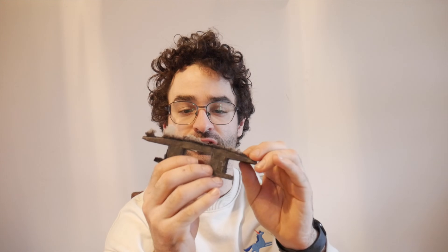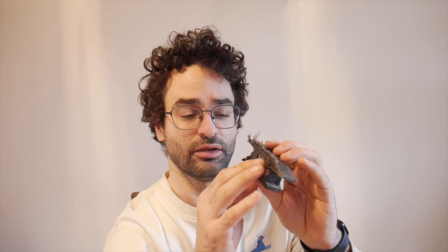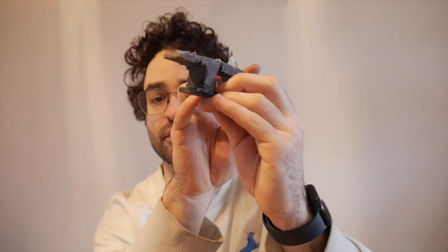We got the cleat out of the mold. There are a few small imperfections and some fiber running up around the plug, but overall it's looking pretty good and feels really strong. I just have to trim up the edges and do a little sanding. The mold unfortunately got destroyed during demolding — I had some geometries that locked it together — but I can correct those design mistakes to extract it better in the future. It's looking more or less like the 3D model, which is okay for the first try, and it should be good enough to do some strength testing.